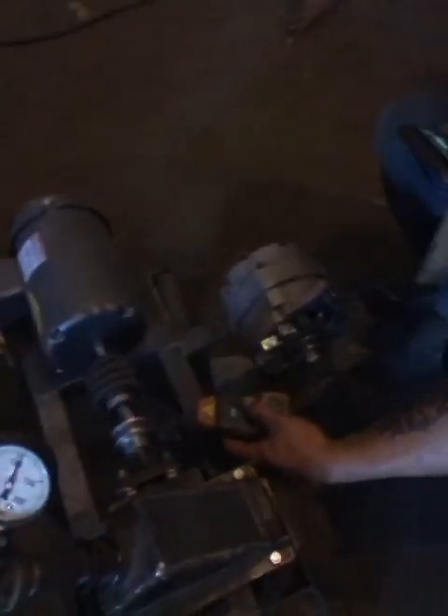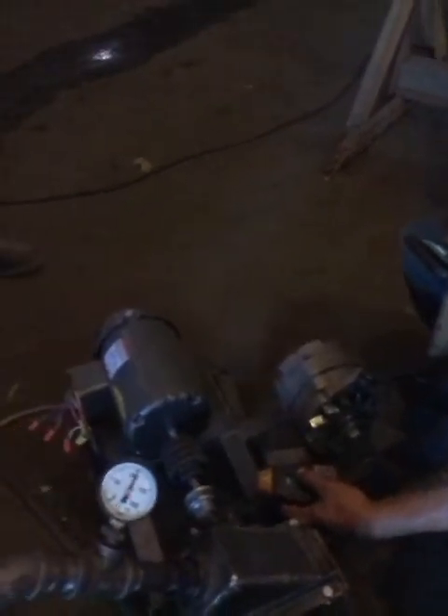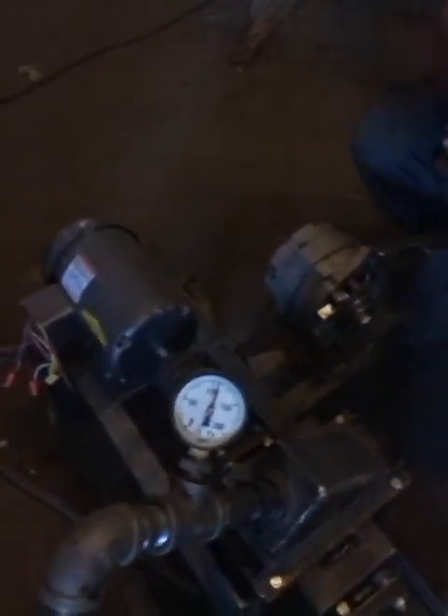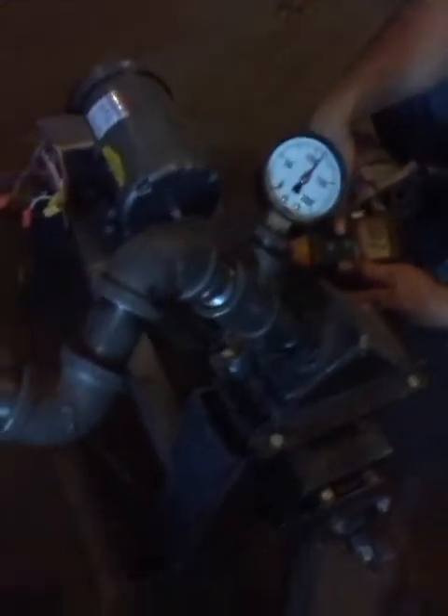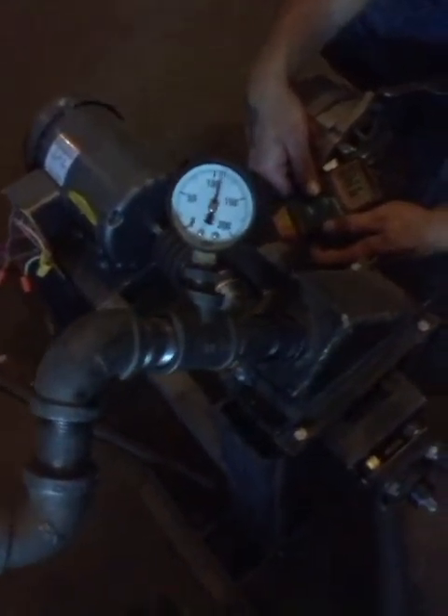That's because we're using a converging nozzle, which turns temperature and pressure into kinetic energy — and that is not the nozzle that Warren Rice used. He didn't use that nozzle for a good reason: if he didn't have any temperature to go along with it, he wouldn't get any rotation, just like we're not getting any rotation. We'll come back in just a bit.